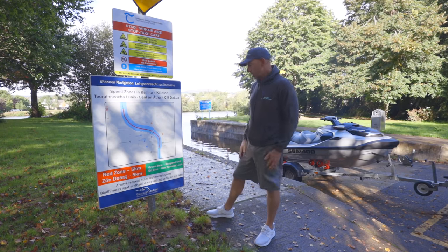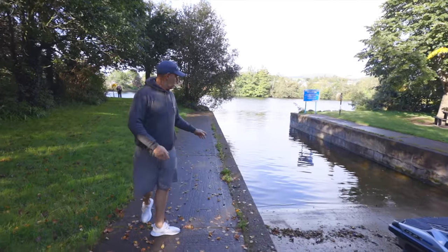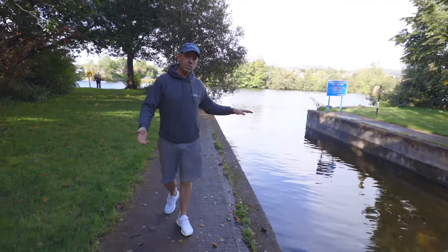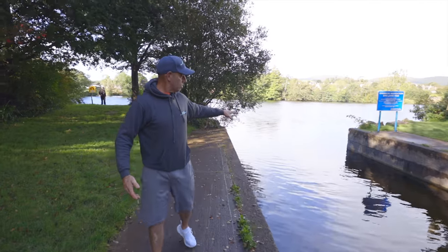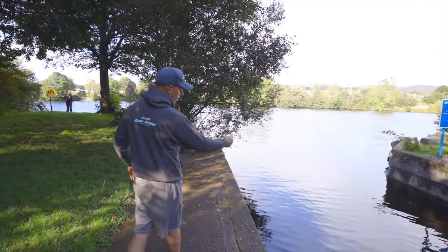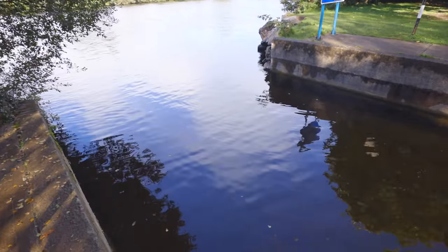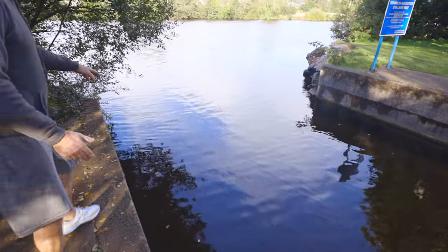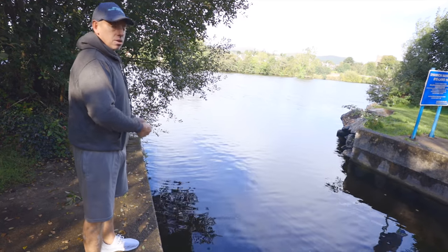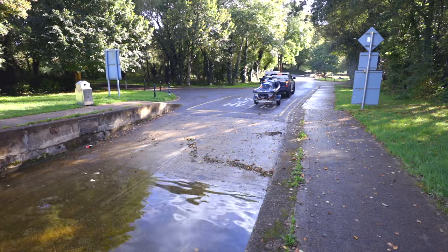When you're on a slipway, take a walk along and check your depth. A lot of slipways were built with concrete poured down, and over 10, 15, or 20 years the ground has been washed away, so as you walk out along the slip you'll actually have a drop-off — it can be quite dangerous. When you back your craft in, if you get your wheels off the edge you won't get them back up; you'll have to get in the water with your mates and it can be a mess. We have the ski ready to go and we'll show you how to back it in.